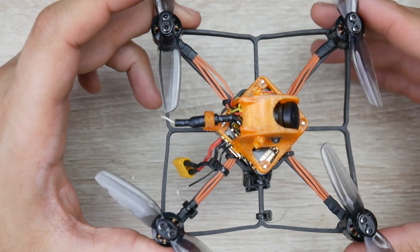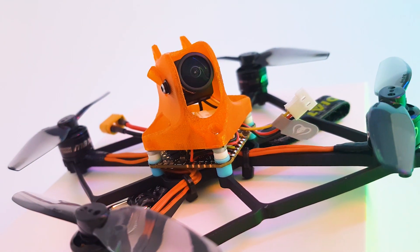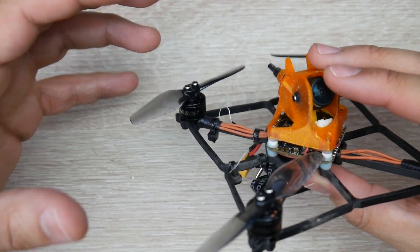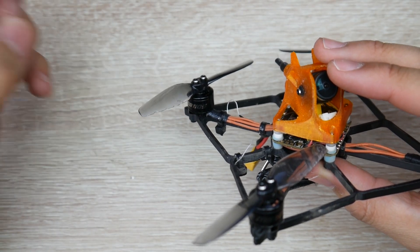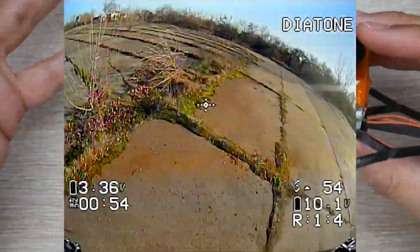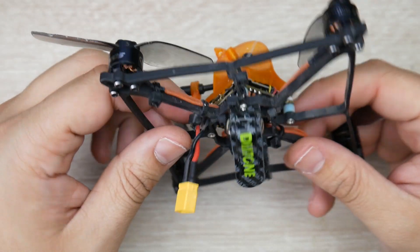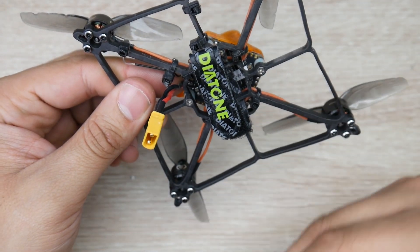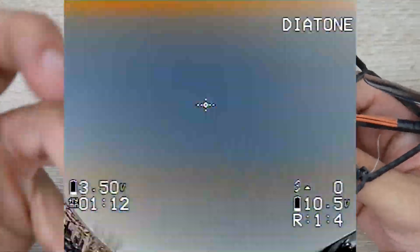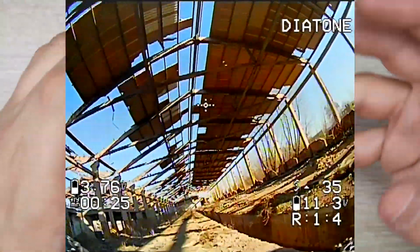Now let's get to the camera and the thing where they missed. It comes in two flavors: the Nano 2, which is an analog camera — really fast, great camera — and the Runcam Split 3, which has HD recording capabilities. However, the issue is you cannot really fly it over 70% throttle because oscillations start to kick in. After flying it, I picked up the quadcopter and noticed there is no low ESR capacitor, which is one of the most important things to add, especially on a tiny build with everything on one board. They usually add that, but this time they did not, and you only have so much space on the board for filtration. So we do have oscillations after 70% throttle, which really kind of killed it for me.